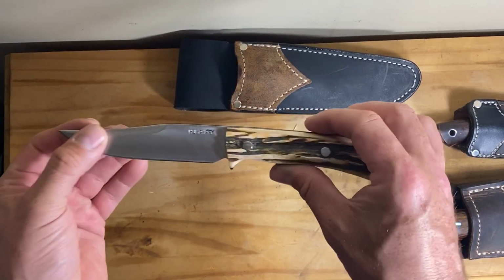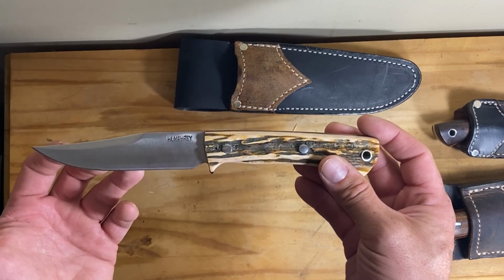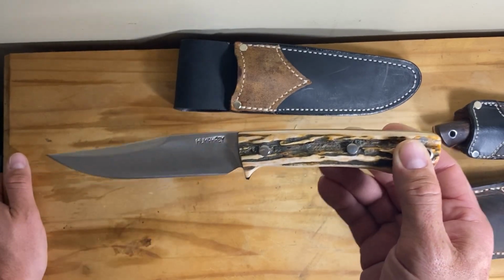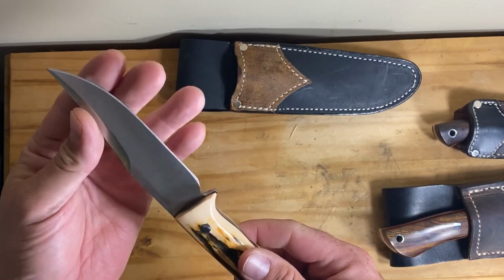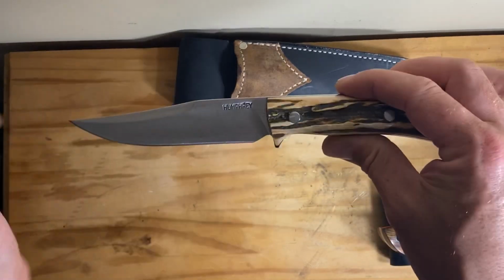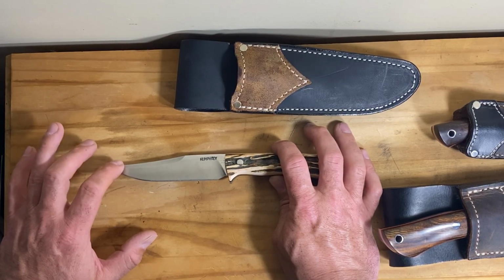But once you learn that sharpening technique and what works well, also the type of edge, sometimes you might find that instead of sharpening at 20 degrees, you want to sharpen at, say, 17. If you do that, that 17-degree edge will sharpen up quicker than a 20-degree edge. And you'll also be able to get more touch-ups on a ceramic rod than you would with a 20-degree edge, because every time you touch it up, you reduce the acuteness of that apex, right? So if you're starting off at 17 degrees versus 20, it's going to take X number of times more touch-ups than it would at a 20-degree secondary bevel to get to the same sort of obtuseness.